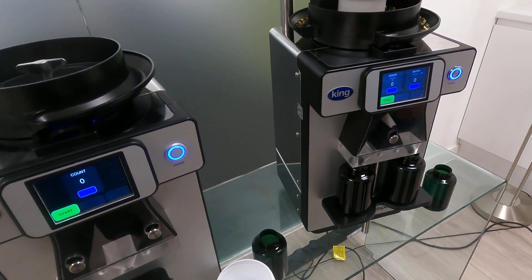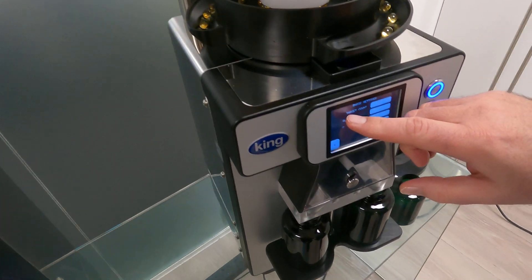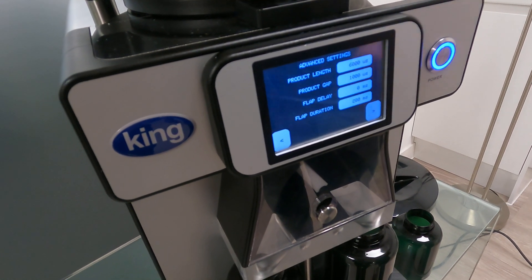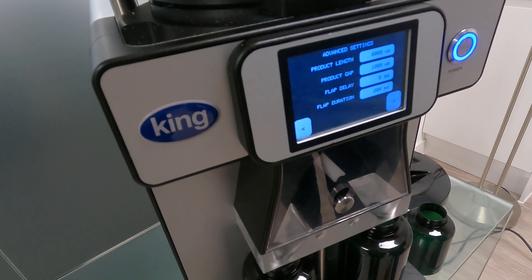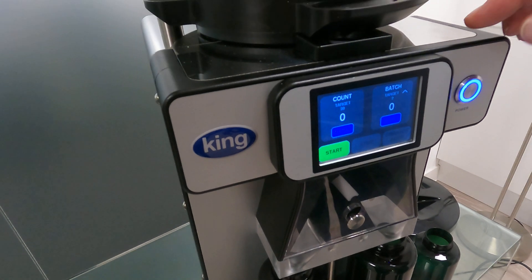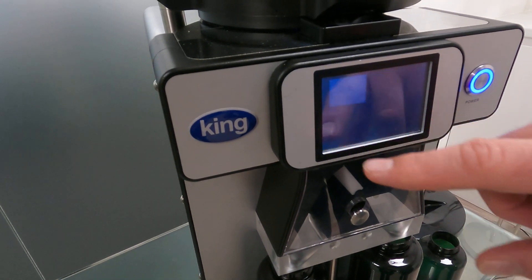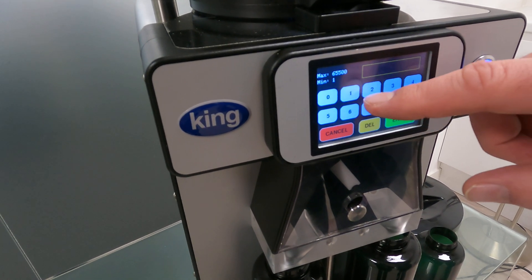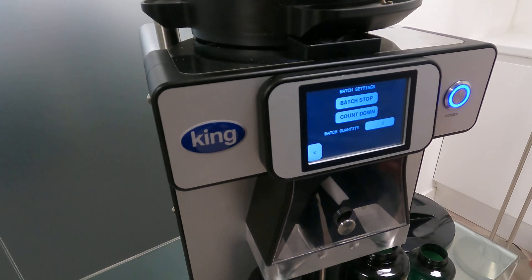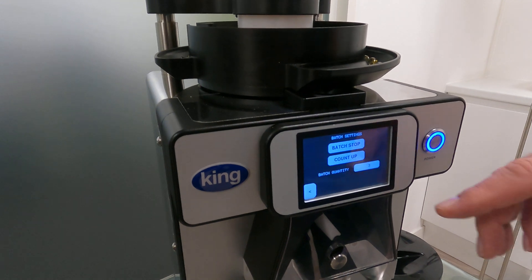For the machine itself, some tablets have been set up here. We can set the count — we've got a count of 30. Very simple controls, with some advanced settings related to the sensor, but you don't even need to touch those much because the sensor has a lot of logic inside it and handles a lot automatically. We're going to do a count of 30 and a batch of maybe three. Some customers like to count up — starting from one, two, three — or count down from 100 to 99 so they can tell exactly where they are. Or you can turn it off completely and just do continuous mode, where the machine isn't counting up or down.